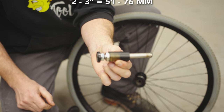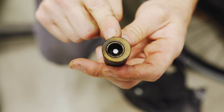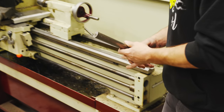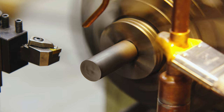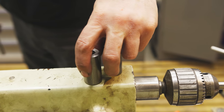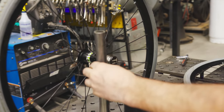These wheelchair wheels have these really cool removable axles. This is a hardened shaft — this is what typically goes into the wheelchair, but I don't want to use this piece. We're going to replace this on the lathe, and then we'll reuse the existing axle. Unfortunately, the wheelchair's hub is titanium, which is great for weight, but it is a pain to weld to. So I'm replacing it with a steel piece.